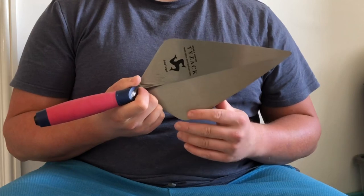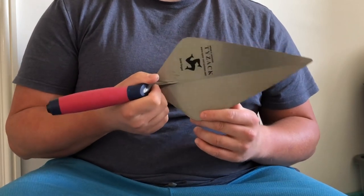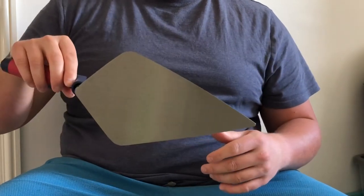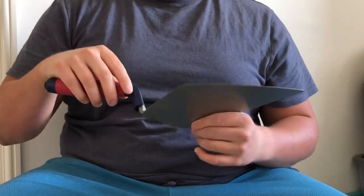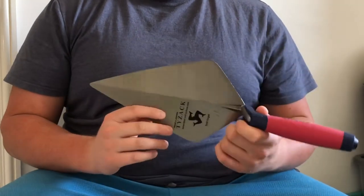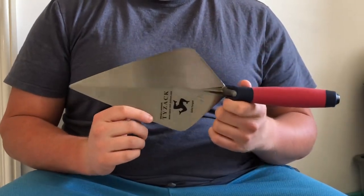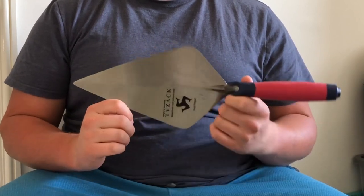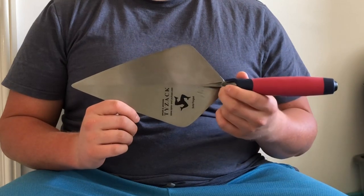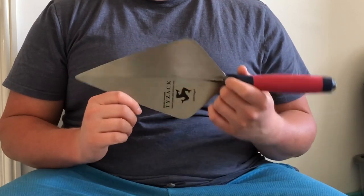At the moment I'm a big fan of the Philadelphia. I'm a big advocate of laying bricks with a pick-and-dip style. Pick and dip requires taking a trowel of mortar, laying it, and then laying your brick at the same time — picking both up at once. This is an ideal trowel to start learning the pick and dip, at 10 inch. You can get either the Spear & Jackson Philadelphia or the London pattern.